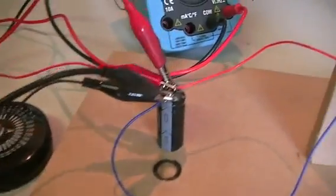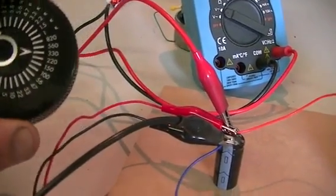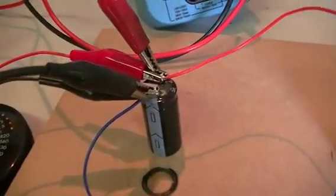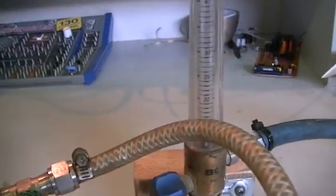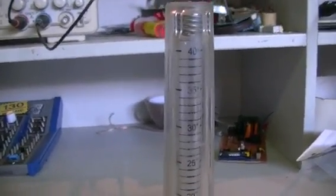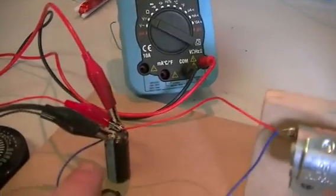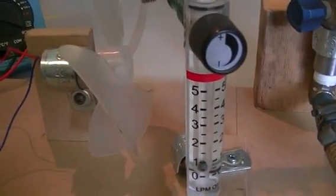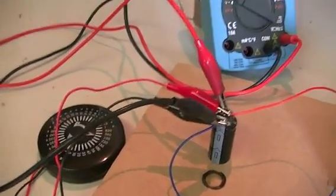This time I have a variable resistor across our capacitor, set at the 330 ohm mark — so 330 ohms across our capacitor. The reason for this is because I am limited to how much air I can flow through that meter, with a limit of 4 litres per minute. We will lift it to about 3.8, shut it off, see how many volts we have across our capacitor-resistor combo, then open the venturi and look at the voltage again.